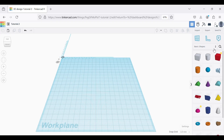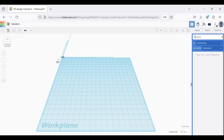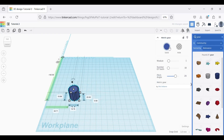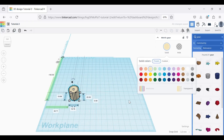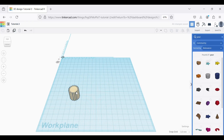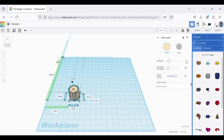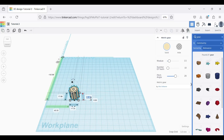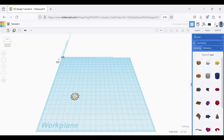Let's start with the small one. Go to the search bar and type in 'gear'. It will pull up the gear — pull it onto the worktop. Change the colour so you can see what you're doing. Click on gear again: it's Modulus 1, but we want Modulus 1.5 because that's the size I want for my gears. It has 18 teeth, but in this case I just want 10 teeth. It'll readjust the gear. Now the gear height is 20mm, so let's change that to 0.2. And we've got the gear slice that we actually want.